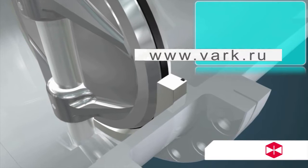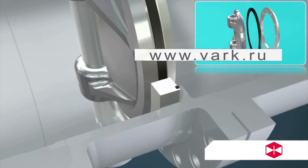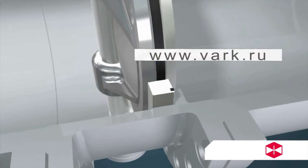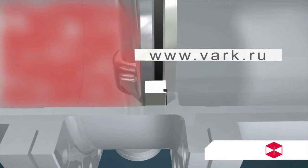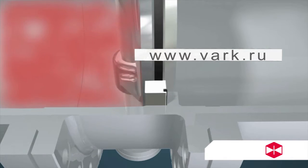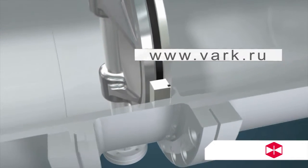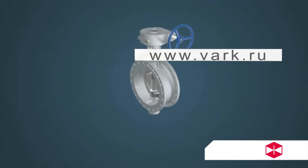Advantage three: the disc uses a stainless steel and graphite layered composite structure. The floating of the butterfly valve may occur during installation or during use when temperature changes. The floating seal ring can compensate for micro disk deformation, keeping the valve seal always in top condition and extending the cycle life of the valve.